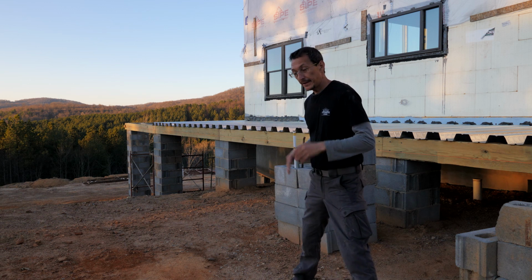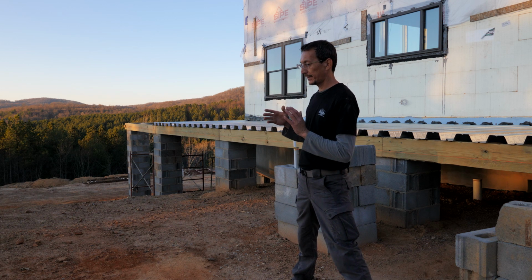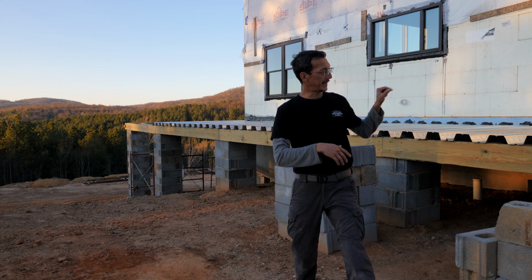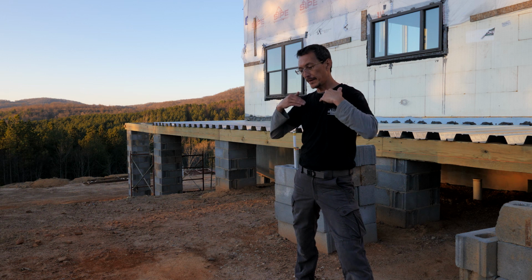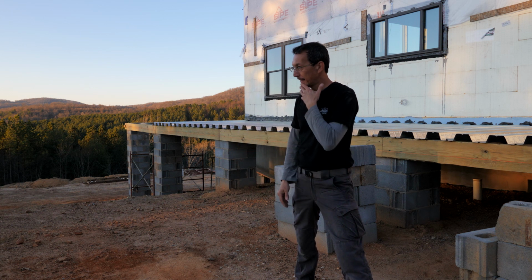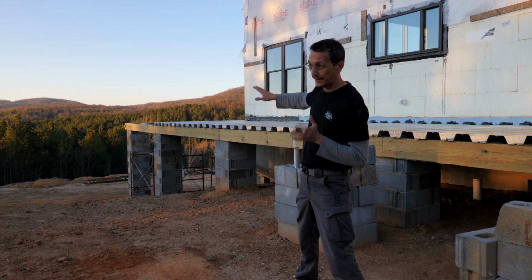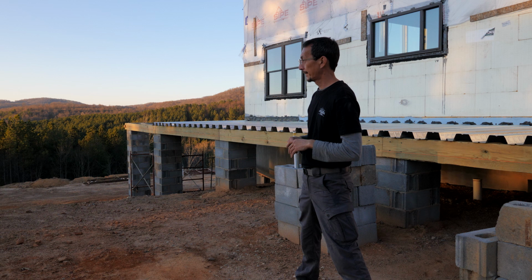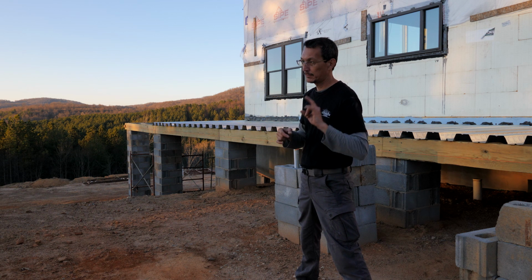Well, it's been a long couple of days, but we got it done. Front porch is done, buttoned down, everything's good, everything is sealed between the deck pan and the house with a little bit of liquid rubber and a little bit of spray foam. That'll help keep the concrete from going under it and running down the wall once we start pouring. I'm happy to have the angle iron in too, that worked perfectly. A lot of fretting and crazy worrying about it, but finally got it done and it worked great.